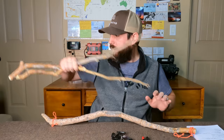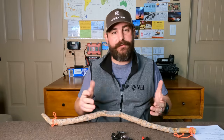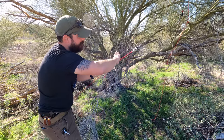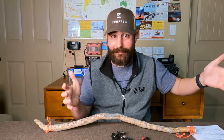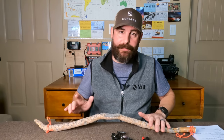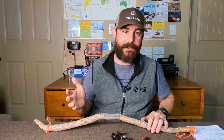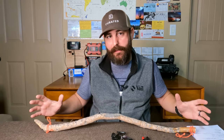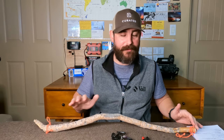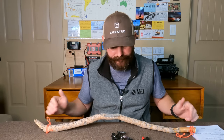My variation was very much dictated by being field expedient. We started out using my guy system because I carry that for my shelter supports, and it worked okay — we actually were able to make that contact. I got some reports that there was a bit of noise there, but that was expected because we had three peaks in the way and were going over 22 miles — I was basically in a small valley. The other two experiments were interesting. While they're not apples to apples because I moved to my backyard and was about a mile and a half closer, my ultimate favorite design is not the triangular structure — it's just too much work to lash them together. Performance-wise, with two and three radials, I could not tell the difference.